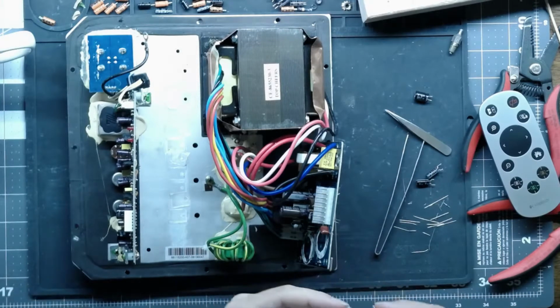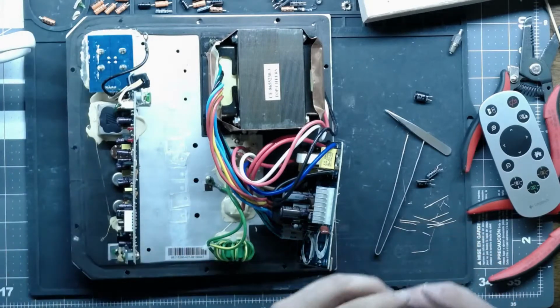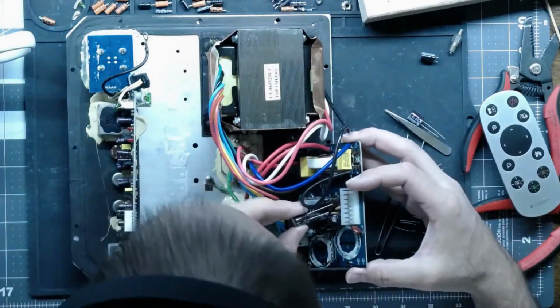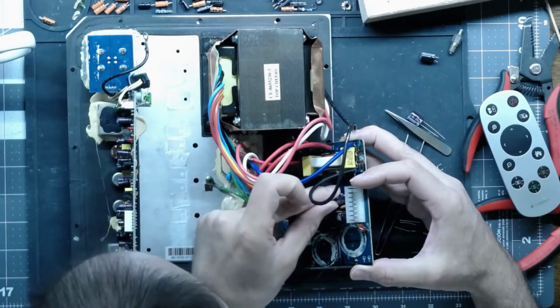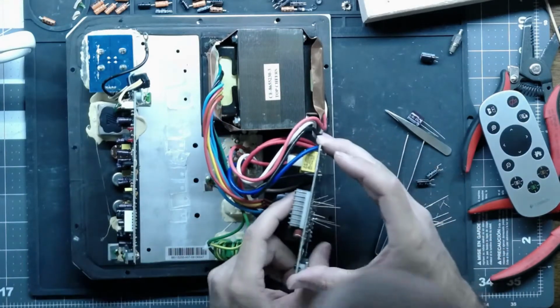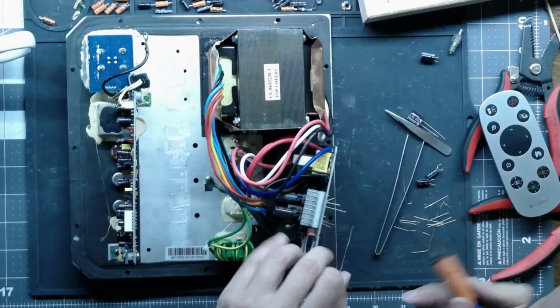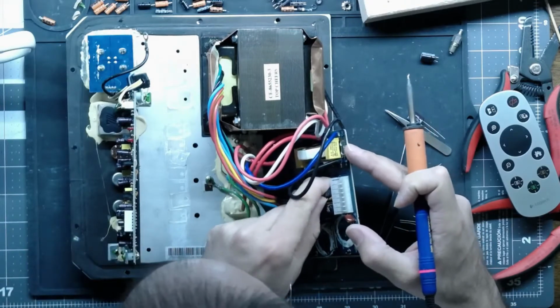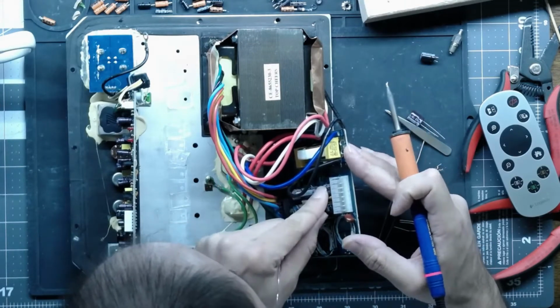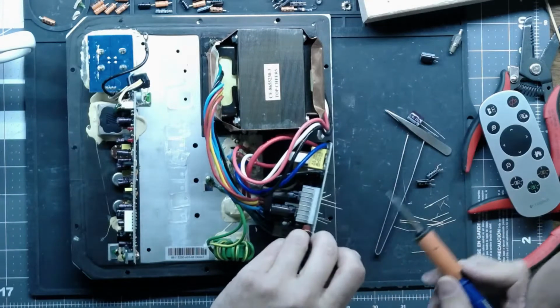These guys are a little bit bigger. Let's see if I have smaller ones in here. And I do not, so he's going to get the ones that are a little bigger. They should fit. A little snug, but it fits. The UPS caps are better. I'd rather do that than go to the smaller can with the UVZ. Check the polarity. Double check. And actually having the larger cap in there will help reinforce some of these when I put a little silicone in there. So I'll just bend the regulators out of the way a little bit, make some room.